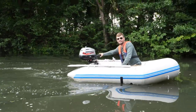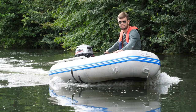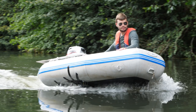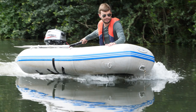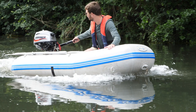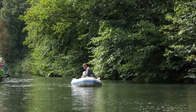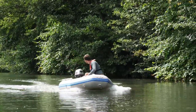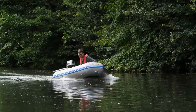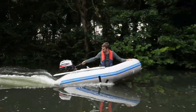Interesting. What was going on? It's cavitating — the prop. You can hear it, it's revving. Cavitation occurs when the prop is too close to the surface of the water and it ends up sucking air down, and therefore it's a lot easier to turn and over-revs. What I think was actually happening though — when you see the boat starts to create lift and it's actually flying at this point — the laminar flow of the wings starts to separate, a bit like how a plane wing stalls. This separation causes turbulence in the water, most likely accompanied with some air bubbles, and this causes the prop to over-rev but not producing any thrust when travelling faster. I tried sitting at the front and at the rear of the boat to change the centre of mass to see if that would make a difference. But no, just more wheelies. I was going to carry out some more tests, even though the results seemed pretty conclusive.